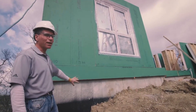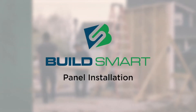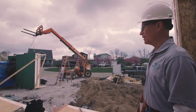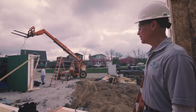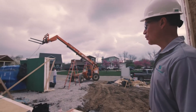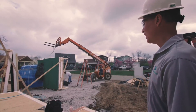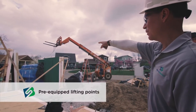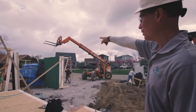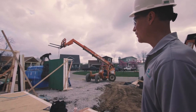We're on site here with the field installation crew at the Mission Cliffs build in Kansas City. The crew is positioning a four-foot door panel rigged up on their all-terrain sky track forklift. It's strapped at two points clipped into the top plate of the door panel, and at the top it's hitched at one point so you can actually swivel the panel around, which comes in handy. They're now working to manipulate the panel into position.